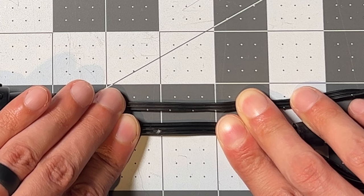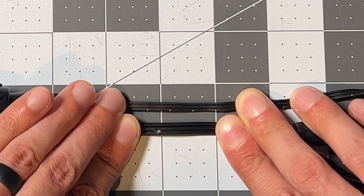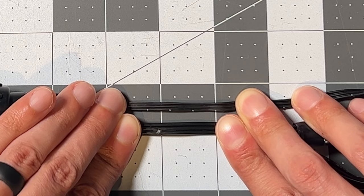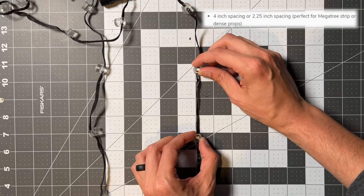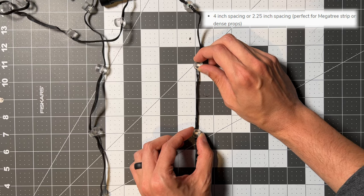Let's take a look at the wiring. On the top we have the EVO and on the bottom bullets. The wire is significantly smaller, as has been well shown and discussed previously. The idea is the EVOs have a lower amperage draw so don't need the same wire thickness, but we'll look at that later. Checking the wire length between pixels, Meadows lists 4 inches on his site but it seems that measurement is center to center and not total wire, which is closer to 3.5 inches.